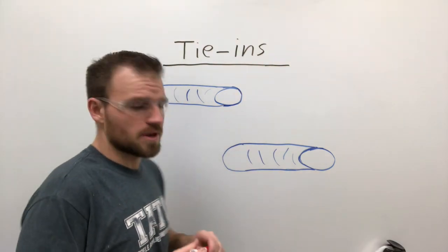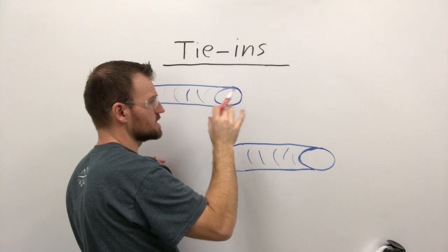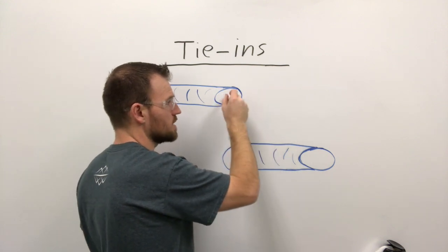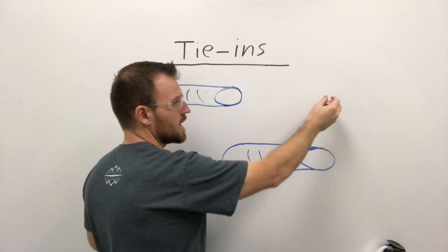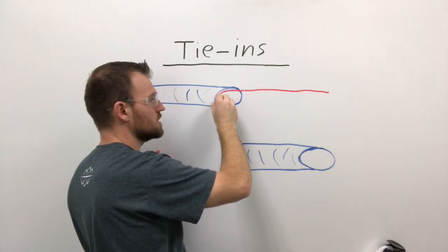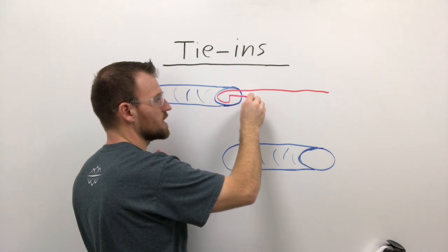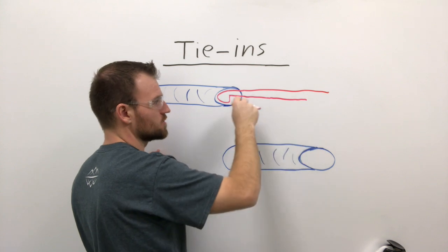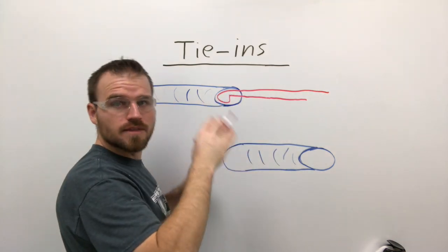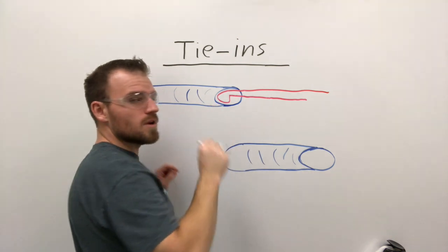What we're going to do is strike up and move back to the crater. We're going to do a sideways six kind of motion — start at the top, swoop in, go to the center, let the puddle fill up, and travel forward. We strike up here, bring it back, do a swooping motion around the outside, bring it up to the center, let it fill for about a half second, and then start traveling forward with a completed weld puddle. We want to avoid striking up outside the area we're going to weld, and move from strike-up to the weld very quickly so we deposit as little weld metal as possible outside the zone.